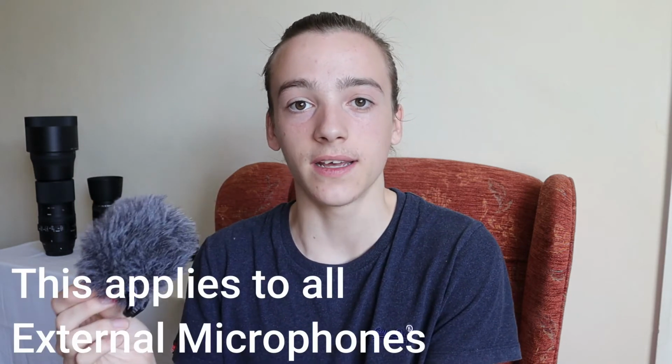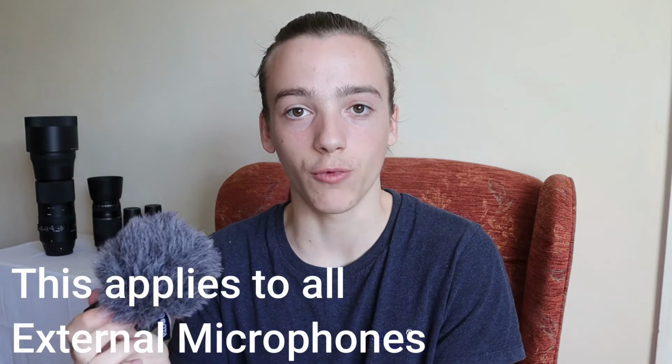So now you know how to set up the microphone on your DSLR camera or your phone, we're going to talk about issues that may arise with the microphone. First of all, you might be hearing wind on your microphone. Now, when I originally got this microphone, I had it on top of my camera, and the camera lens makes noise as it focuses, so just make sure it's not actually lens focus noise instead of wind. So if you want to use this microphone, it's a good idea to have it away from the camera.